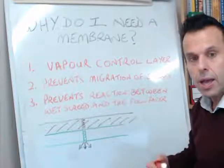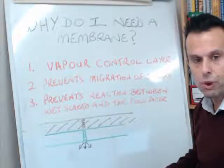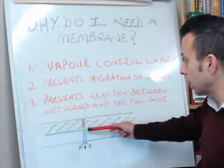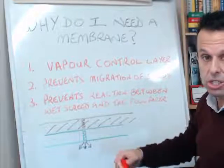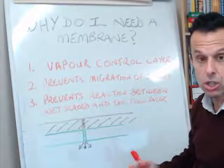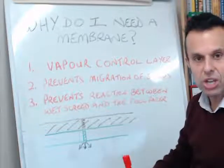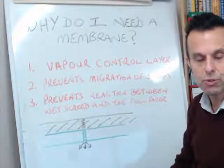That's something the board manufacturers have in their notes, and I'd be happy to send that data to anybody that would like to see it. So that's a really big reason to put a slip membrane over the top of the insulation board. Really, it comes down to three reasons why it's best practice and essentially essential. You're probably getting 50% of projects that don't use it, and initially you're not seeing anything adverse happening. But this is best practice, and we'd like you to enjoy your screed for the design life of 50 or 100 years, rather than experiencing issues further down the line.